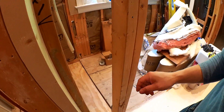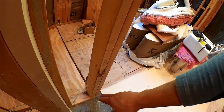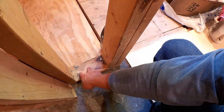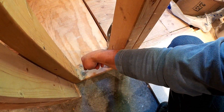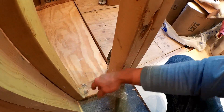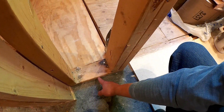Another thing you might want to consider is potentially drilling a couple of holes where the conduit meets the floor here — drill here and then have another hole drilled here to kind of meet in the middle, so that you have like a little bit of an L-shape going up to the conduit, so that the wire has somewhere to go.